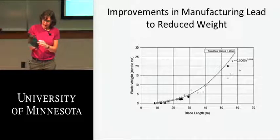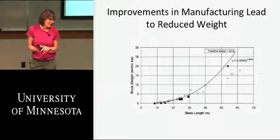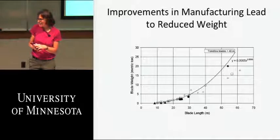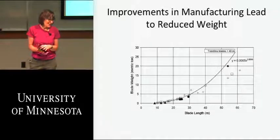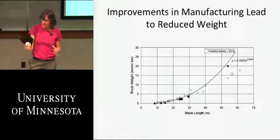So again, it's black, so that's the graphite. Don't be deceived. Anytime you see something that's composite that's black, it doesn't necessarily mean that it's a graphite composite. People are very tricky. They can put carbon black in the resin, and then it'll still look black. So black doesn't always mean it isn't glass. But this one is carbon.